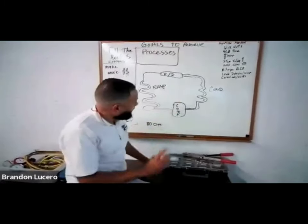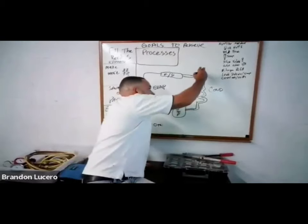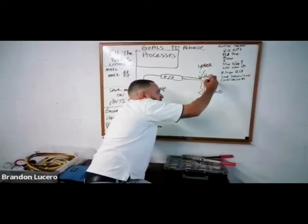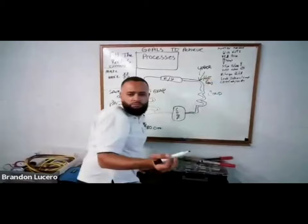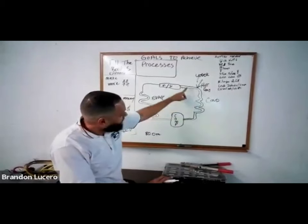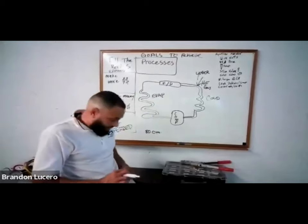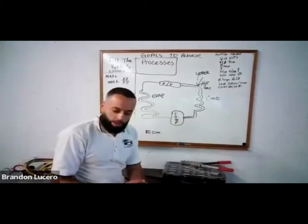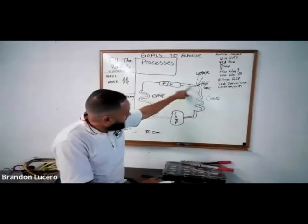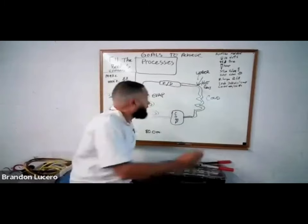The leak could be anywhere. I want to make one side note about this particular part - this here is called our yoder loop, or some people call it a hot gas loop. This portion of copper tubing runs interior of the unit, normally where the freezer gasket meets the bulkhead. They do that because it's warm and it prevents moisture buildup when the gasket makes contact. We can't easily test that for a leak, but there is a way to check it.